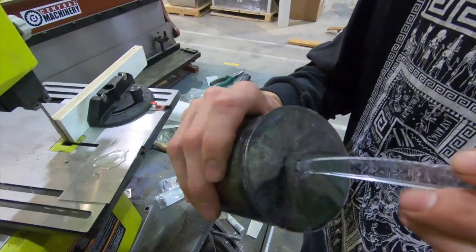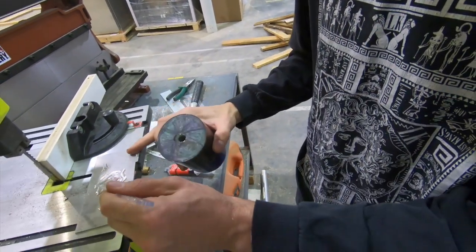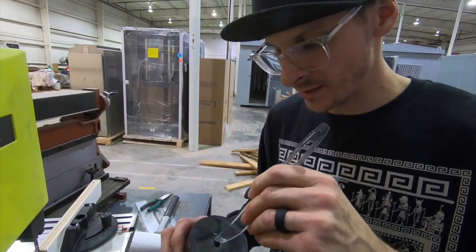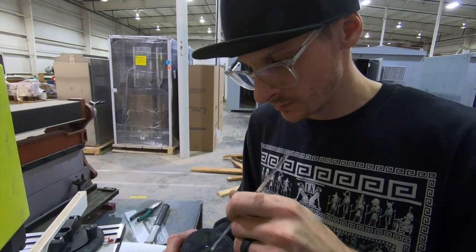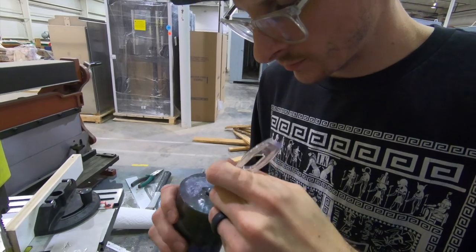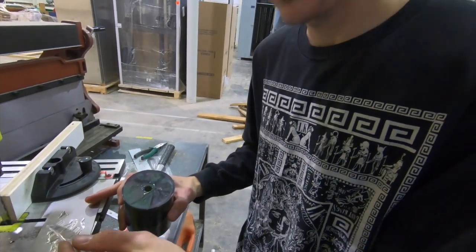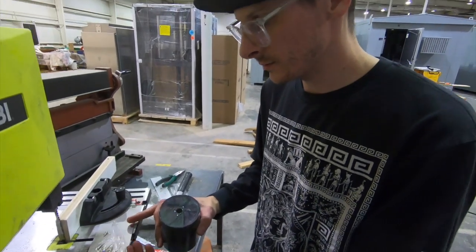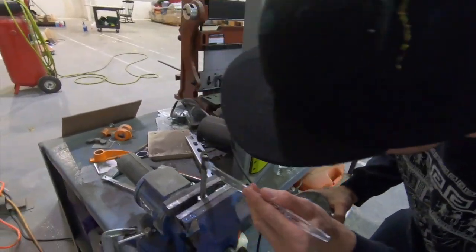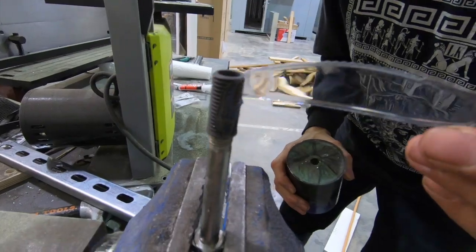Oops, sorry. So I put a little bit inside here just to kind of help grease it up a little bit. Because putting these threads inside this epoxy is actually kind of a pain in the butt. This stuff doesn't have any give like wood. Pretty much you're just lubing the hole a little bit, so it's easier for that threaded insert to go in there. I put a little bit on the insert like that, you know. Oh, okay. Spread it like butter.